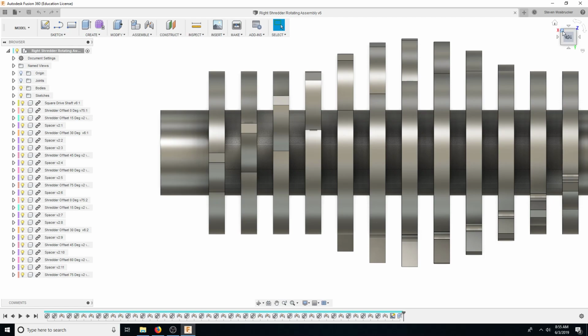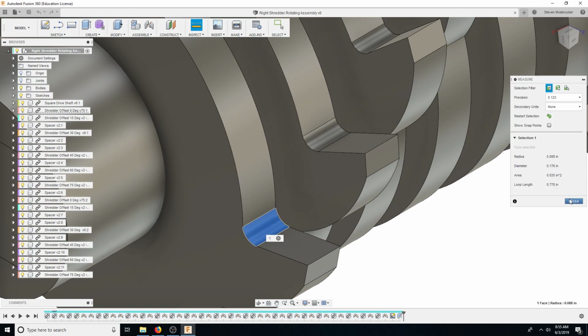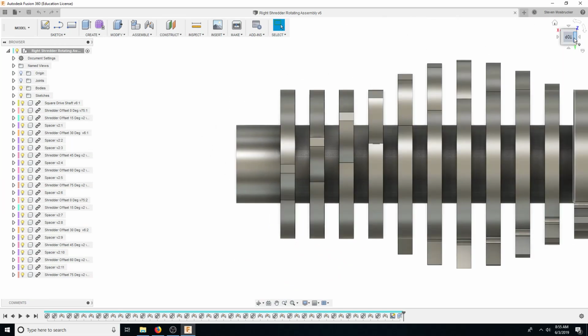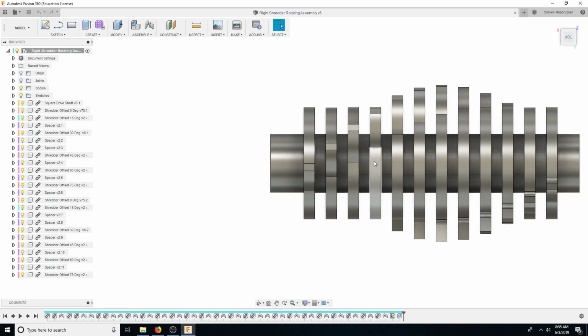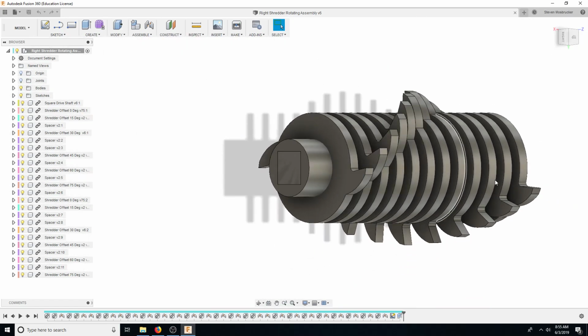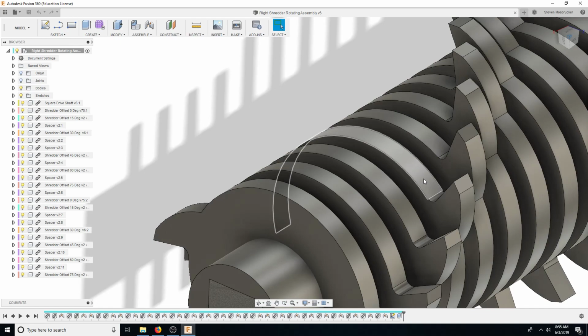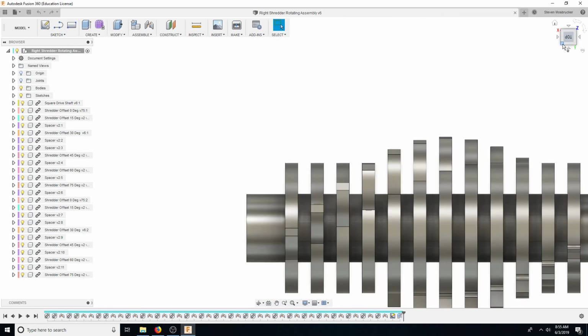The bullnose end mill will probably be this diameter, with this radius here, 0.88. I'll probably get something more than that, but I have that radius there, and I put radiuses everywhere so that stress doesn't concentrate around that area. This would be even stronger than having these square openings, because this doesn't need to go in that deep. In my CAD model, I have this side and this side just barely overlapping. So having some fillets in there would also be pretty nice, even if they're 0.88. That's pretty much a ball end mill, because that times 2 is pretty close to the diameter.